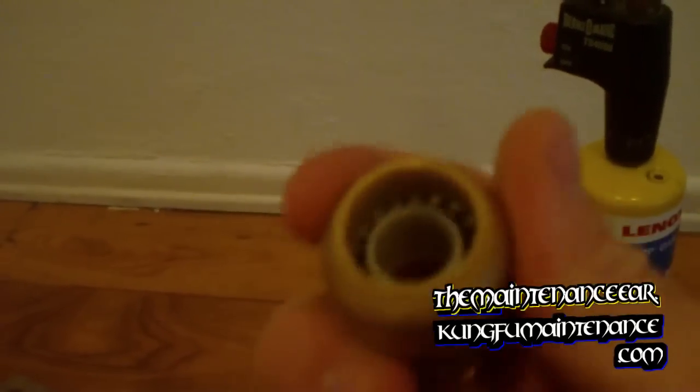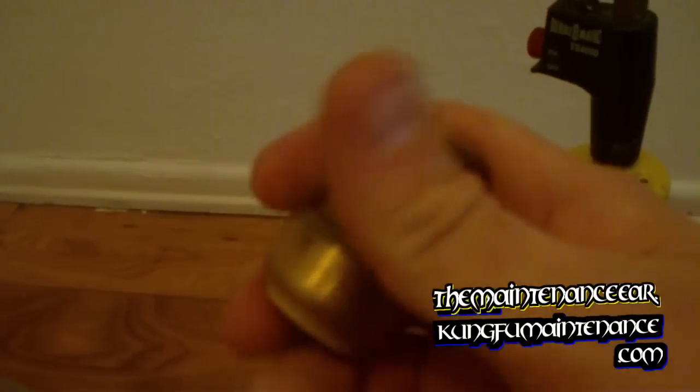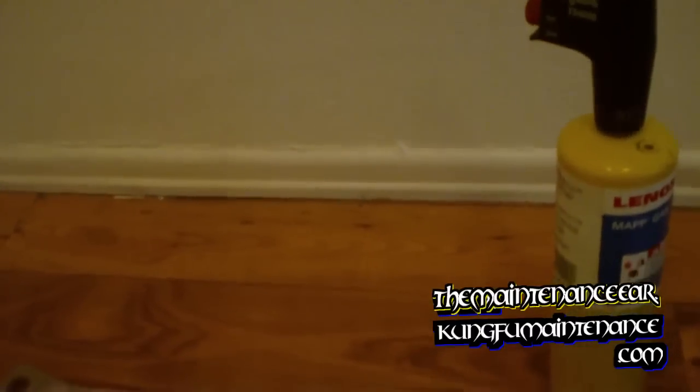I don't know if you've seen these yet, but it's pretty neat. Once you have a line cleaned, it's a no solder union. You can stick this thing right on the pipe and it grabs it there and it won't leak or anything. It's got this release deal that you can release it if you need to. It's a solderless fitting, so you can just slip it on and be good to go as long as it's the right size. It's my plan B. If I get stuck and the solder's not taking, or there's water in the lines or any other various things, this is a good plan B. These are kind of expensive, $10 a piece or whatnot.